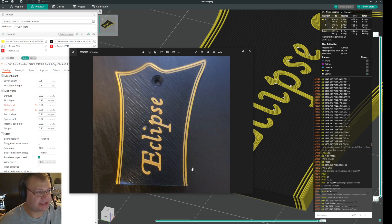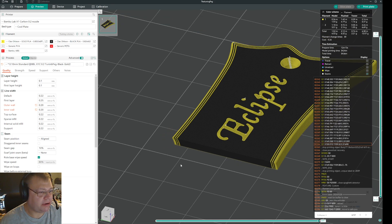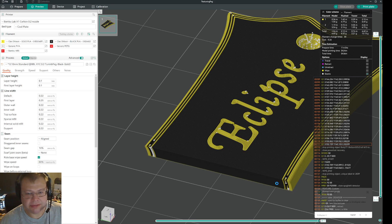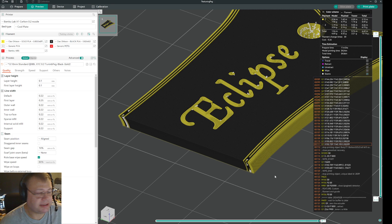I have used ironing, so it looks kind of nice. So I just wanted to show you guys that — if you have a line width that is the problem, and not actually the model, you can fix it by adjusting the outer wall width setting in the slicer to match your nozzle size.